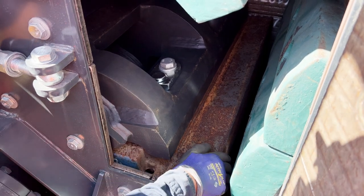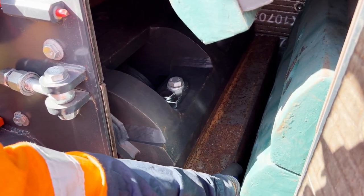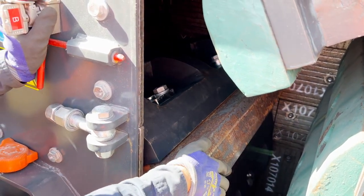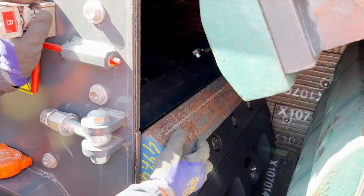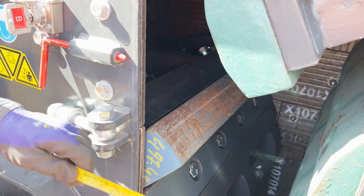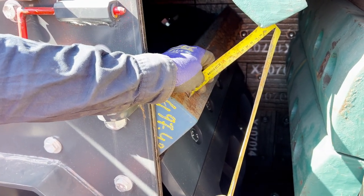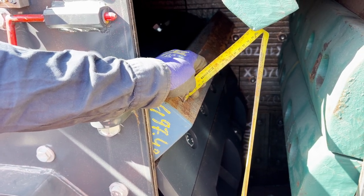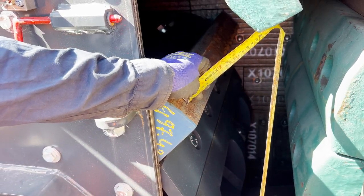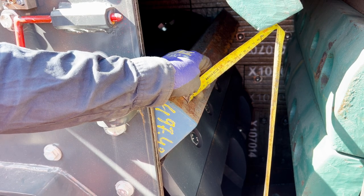To check our close size setting between the top apron and the blow bar, we need to bring the blow bar up. The blow bar will slide back in because it's new. So when measuring the top apron close size setting, we subtract 15mm from our measurements. We have around 200mm there, so roughly around 185mm currently.